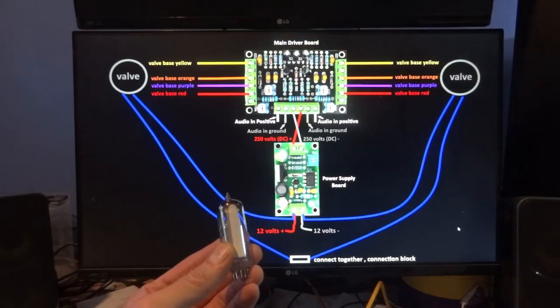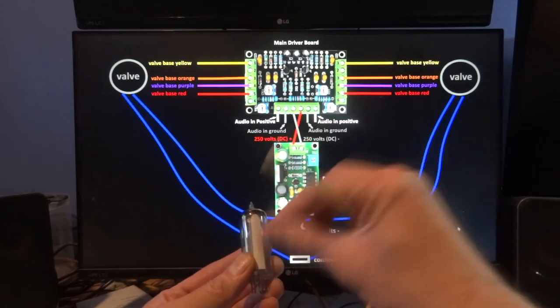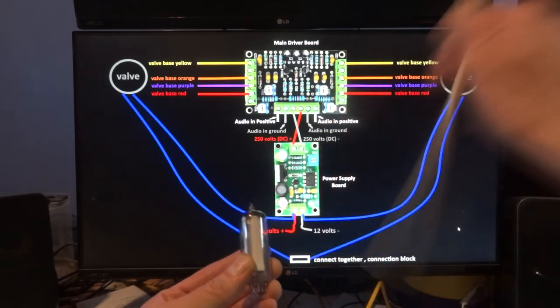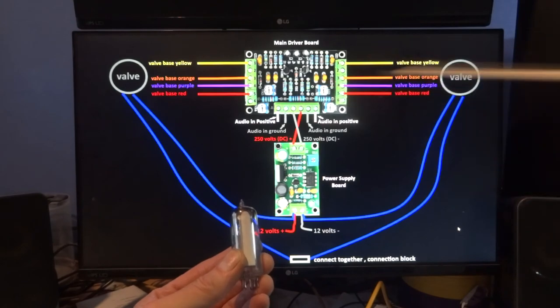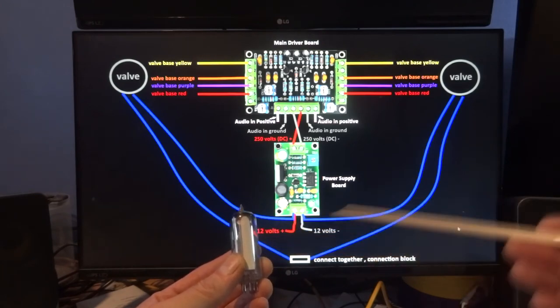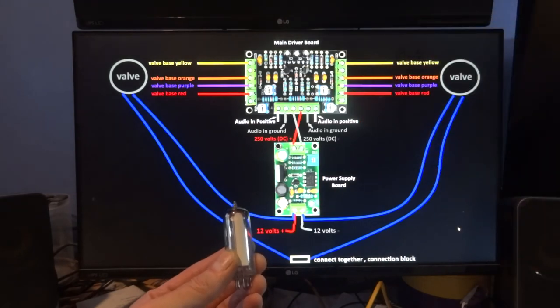Well, VR3, this pot here, and VR1, this pot here, this is for the left channel, say, which it is. As the music hits its peak, these bars will close up. They will touch each other, so to speak. This is how much they will touch. You can get them overlapping if you want to. I have it so they just nearly touch. So at full volume, like a big bass drum hit, full modulation, these lines near enough touch, and you can adjust that with this variable resistor, VR3, and the same with VR1 for the right channel.